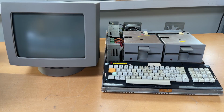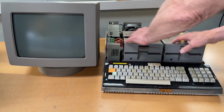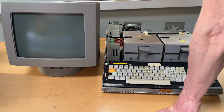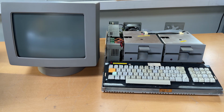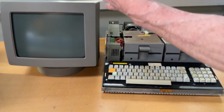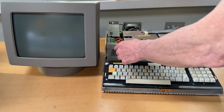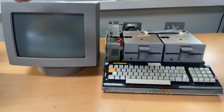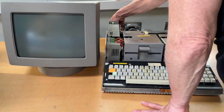It's together again, and as you can see, the keyboard's put in, floppy disk drive, power supply, obviously the motherboard. I've connected the monitor in the back, hooked up the power, I think, so we should be able to turn it on if it works. So, crossing fingers. When I turn it on, the red light up here should light up, and then it should make a beep, and it should spin up, and show some boot sector bootstrap thingy on the screen. So let's try and see.